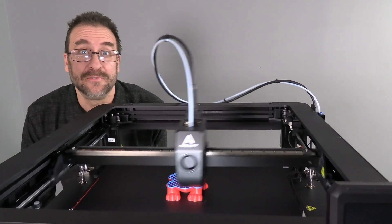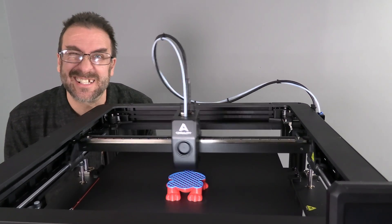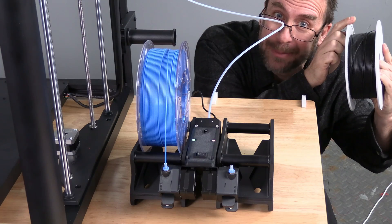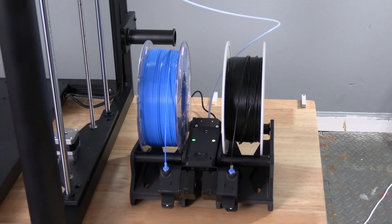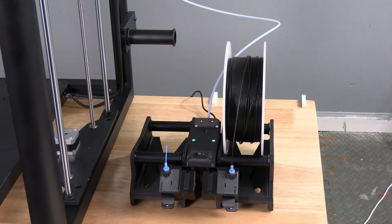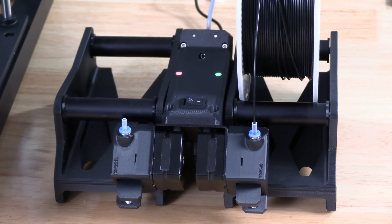We've done it — the Infinity Flow S1 Auto Filament Changer has successfully swapped from the empty spool to the full spool. You can see where it happened with the perfect color change from red to blue here on the Creality Ender 5 Max. It worked absolutely perfectly. Here I've got Bambu PLA Basic black — we will feed this into the original spool. What a coincidence, the blue just ran out and the light switched red. The Bambu has switched green and it's feeding.